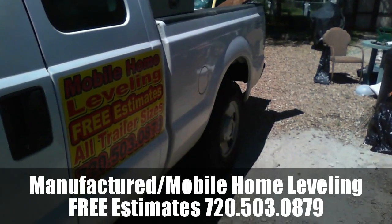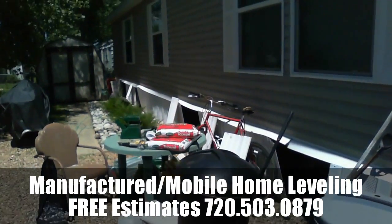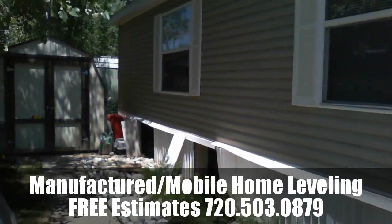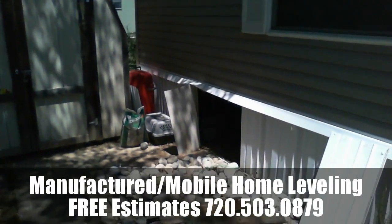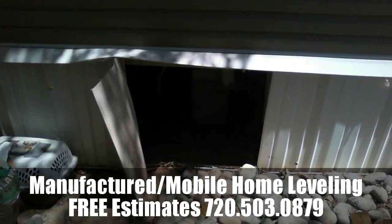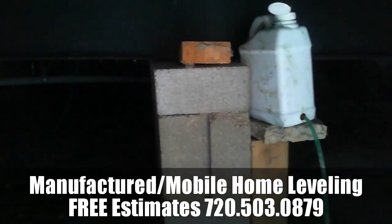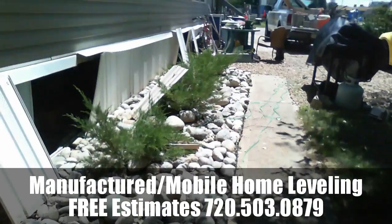Welcome to MB Vista's Foundation Repair. We're on a mobile home double-wide trailer foundation and we're re-leveling the entire double-wide back to its original horizontal position, which is getting all four I-beams back level. We set up our water leveler and go through to find out which area is the high point, then go through and get the rest of the house level with that high point.